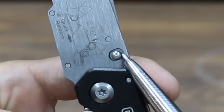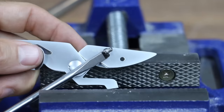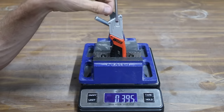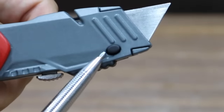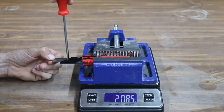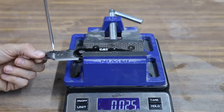Let's see how much force it takes to change the blades. The Black & Decker has a small metal button and takes almost a pound of force — a pretty easy blade change. The DeWalt takes more than three times that force at three pounds. The Gerber requires removing a screw, which would be easy to lose. The Husky's blade release is pretty small, sliding towards the handle, and is easy on the fingertips at only a quarter pound. The Crescent's release is recessed but large and easy to work with at one third of a pound. The Stanley FatMax is pretty hard on the fingertips at 4.2 pounds. The Craftsman takes about seven pounds of force on a tiny squishy button, making it pretty much impossible if you're wearing gloves. The Milwaukee has a small metal extension over the blade release for safety, so applying two pounds on a button that's difficult to access is a bit of a challenge. The Irwin also has a metal extension and takes even more pressure than the Milwaukee at just over three pounds.